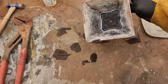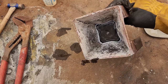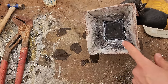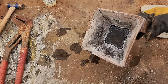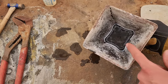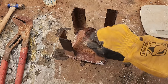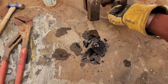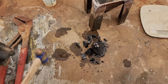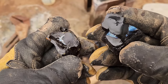Here is the exact same flux recipe with the oxidizer, with the bismuth oxide, and nails after it's all molten. But this is some concentrates from my new gold mine, and I know these are pretty much pure iron sulfides. You can already see the difference in the slag, but I wanted to do one for comparison, so we can check the difference between this one and the other stuff from Ghana. Here's my sulfide slag, and here's the stuff from Ghana.